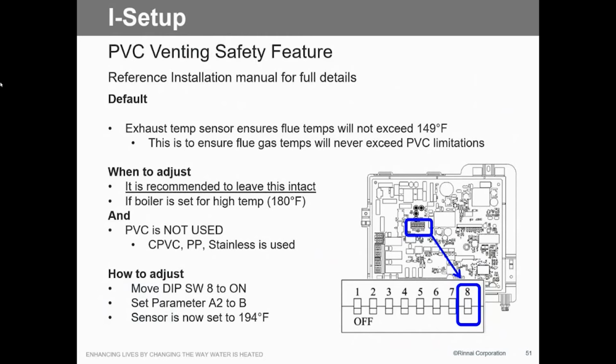Have you been on an application where they've PVC'd in a high temp situation? I mean, how often is that duty cycle? Absolutely. I don't know, I've never timed it, but I found that it does work. Right, but if it's 20 below and we've got a major heat call, how often are we duty cycling or shutting down? It just depends on the return temperature coming back. In-floor heat, not very often at all, but you're not gonna run high temperature. No. And that's the only one I've really been on, to tell you the truth.